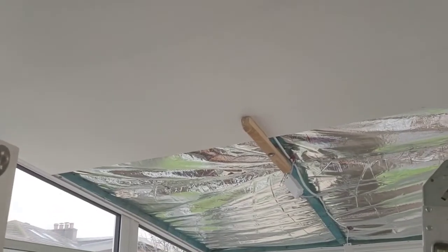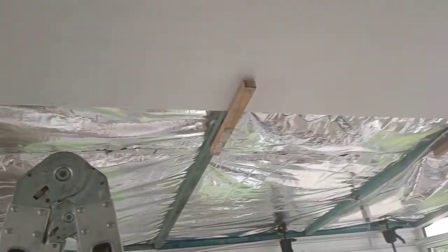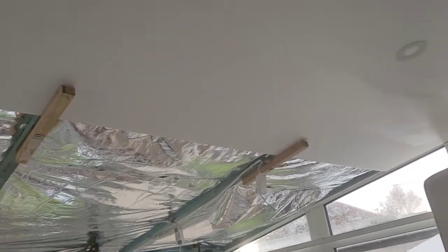The next clip shows the board in question after it has had the tongue and grooves fully engaged, and I have then in effect converted the three swing supports into mild clamps. I've simply screwed them up a bit further to apply a bit of pressure to help with the glue setting.